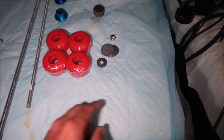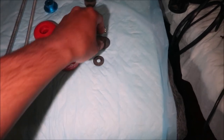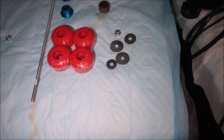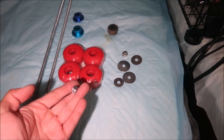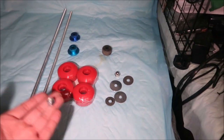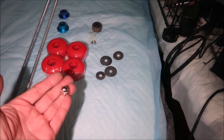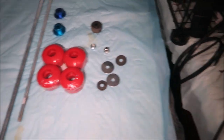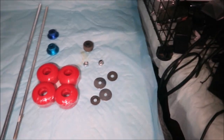You could use the wheel bearing, but that'll make the nut stick out and you want the nut as far in as possible. What we're going to do is grind them down to size so they fit in there and press them in so they won't fall out. I might go with the 3/8 — I think it'll fit pretty good. You'll also need some locking nuts. These are 5/16 nylon locking nuts — really inexpensive from Lowe's. Haze Mega suggests buying SAE stuff if you're in America because it's cheaper and easier to find.